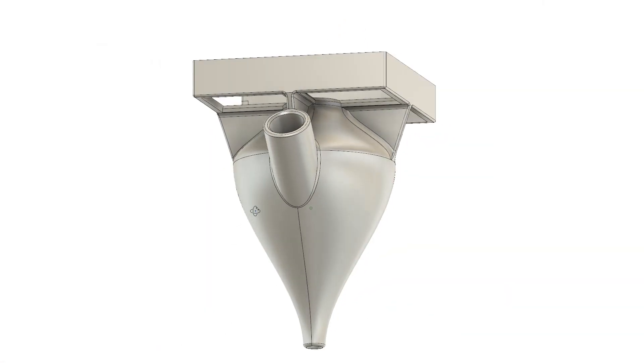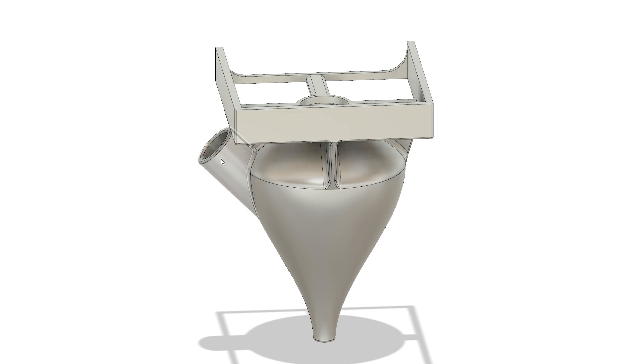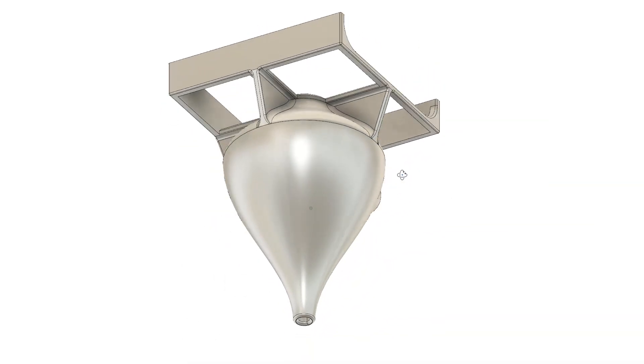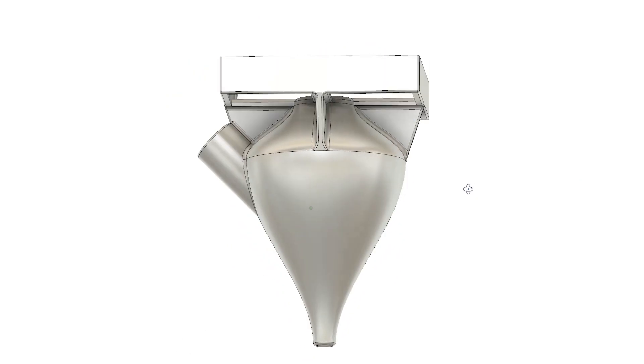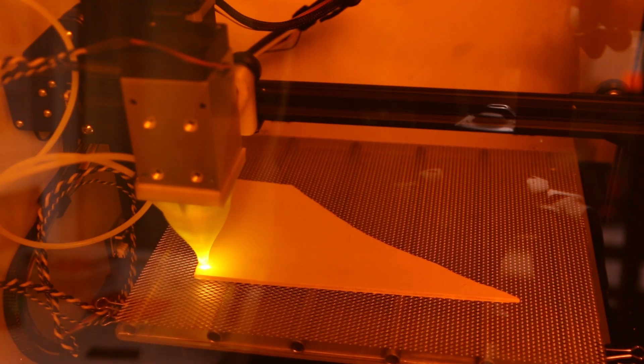The second part of the build: now that I have a decent enclosure I can also get an air assist going, which will constantly blow air right where the laser is cutting. To do that I designed a 3D printed attachment that accepts pressurized air into the side and snaps over the laser itself. It allows the cooling air from the laser diode to go out the top, but has a nice cone that focuses the air right where I need it so all the smoke is immediately blown out of the way while cutting.